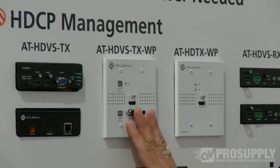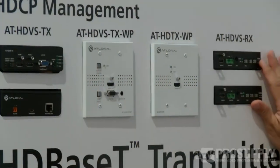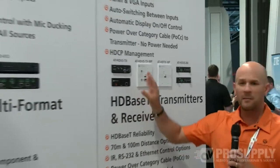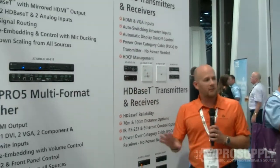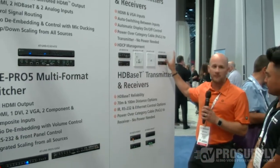Those connect directly with the receiver, which is our HDVS RX. This is a scaling receiver, so it takes video in from the transmitter over HDBaseT signal and category cable, and will scale it to whatever resolution our display is. So the presenter who walks up and plugs in — it doesn't matter what resolution is on their laptop — the scaler will fix that and match it up to the display, making it really easy to use.